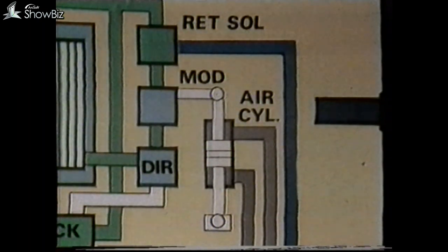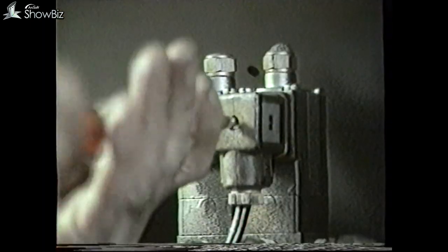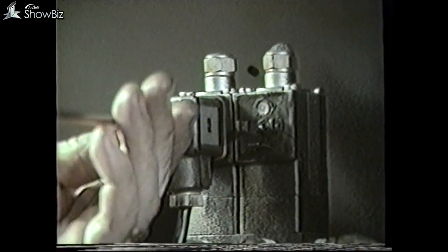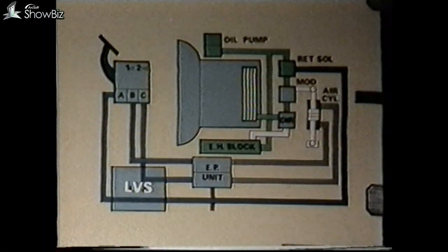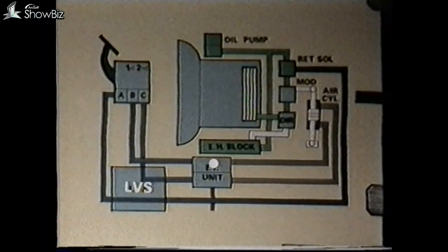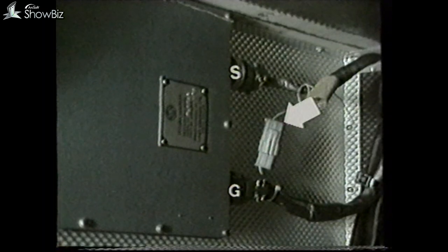This can be carried out again with a test lamp on the supply plug which is close to the solenoid. If no supply was present, it would indicate a wiring fault from the panel to the solenoid or the panel itself. But if there was a supply, a solenoid fault would be apparent. If on your maintenance check you found that the first stage cylinder was not operating, one of the simplest checks to do is to connect the second stage EP unit to the first stage EP. This can be done by removing the single screw in the cover of each plug and changing them over.